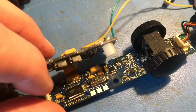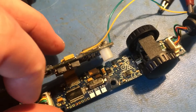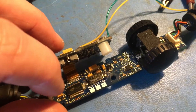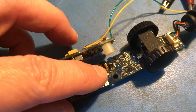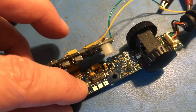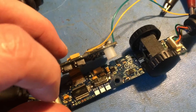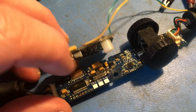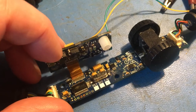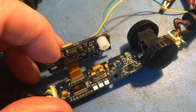I put an oscilloscope onto the clock, and in the failed mode - where the LED wasn't coming on or was on permanently - I found there was no oscillation on either end of the crystal. When it was operating correctly, you can see a four megahertz sine wave on the crystal. Interestingly, I resoldered the joints and it started working and seemed reliable for a while, but then I left it overnight and in the morning it was showing the original faulty symptoms again.